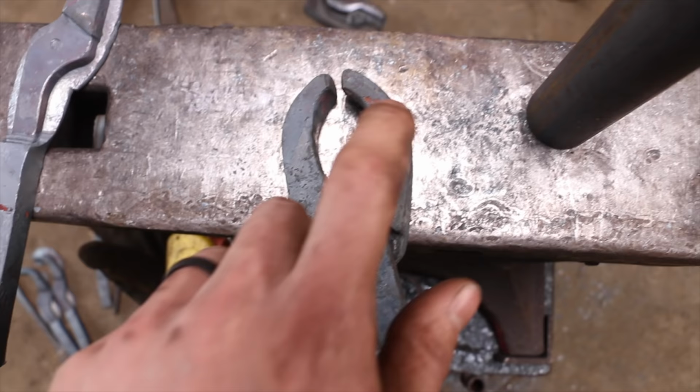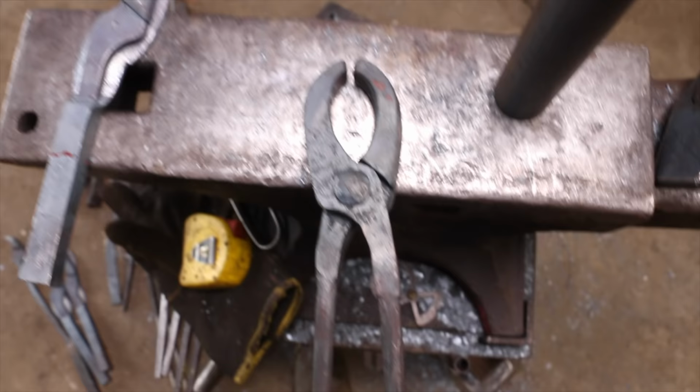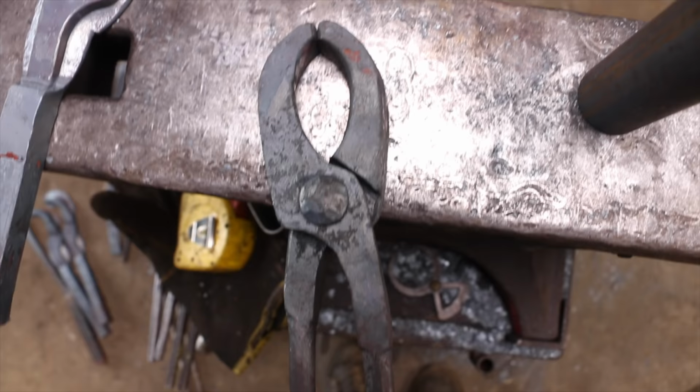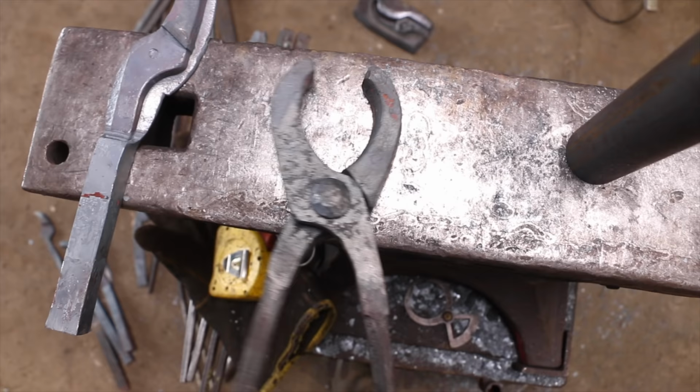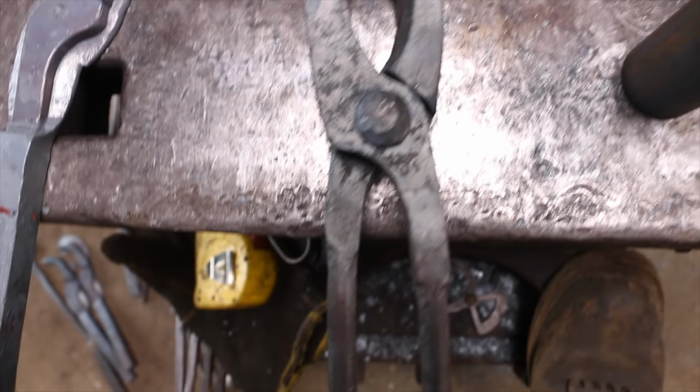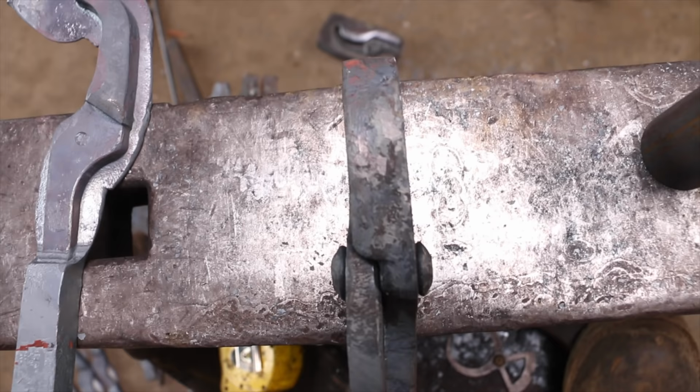So there's two ways to go around that. Either make the shoulder here, and actually also it's very limiting. That's the range of motion. But because you have both hands on this typically, or can under the power hammer, you want more motion than that because you might be grabbing a thick to thin piece, right? So there's two ways to go about it. Either this shoulder gets opened up a lot more, so you have bigger range, or the other option would be to go to a flat bar scenario where they run parallel and there's no shoulder, so that would look like cutting this out in here. That was something I was thinking about going for in the beginning, but I kind of like the thicker part here. It gives you some options.